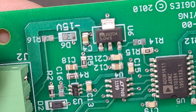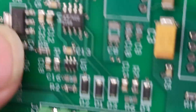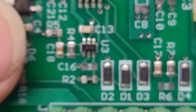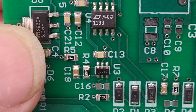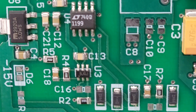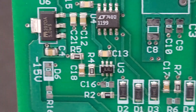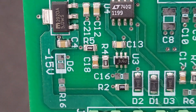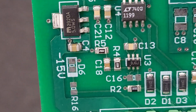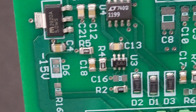U6 is a 2902 Alpha — that is a 5-volt low dropout regulator. U3 is marked BJGJ; I was able to cross-reference that to the package — it comes up as an RT9011 dual LDO.